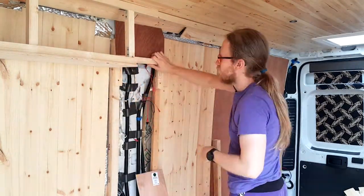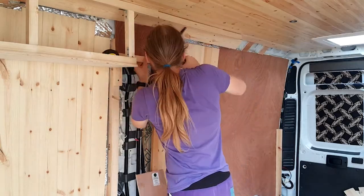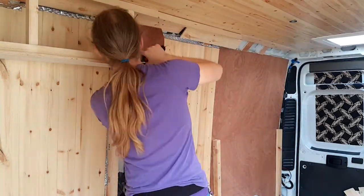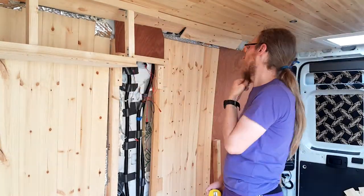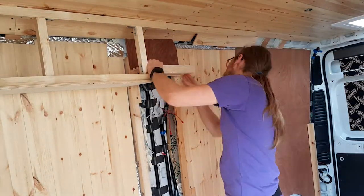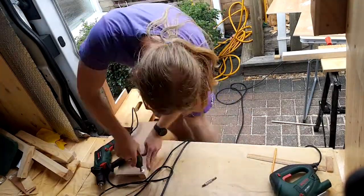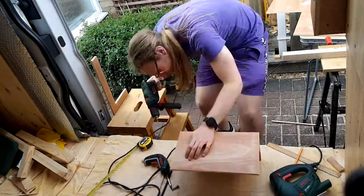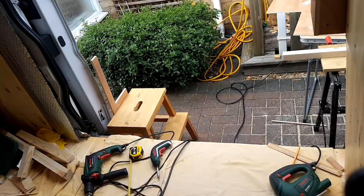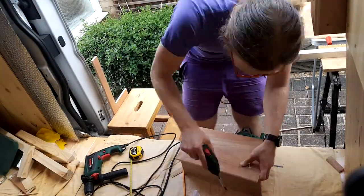I then built a little shelf out of 12mm ply that I had left over, and then cut a bit of batten to attach to the front to start providing the top part of the frame that the front would screw into. I knew I would want to pop this off for maintenance, so I wanted to make sure that the front could be unscrewed and screwed back on quite easily without needing to mess with anything else — both to help me finish off the front at a later point and also in case I ever want to change anything or need to get to the wiring. I then cut the front, which is actually housing all the control panel bits, and attached that to the shelf and the frame to get the right sizes for the additional little bits of batten and also get the height so I could see where the bottom was going to be.